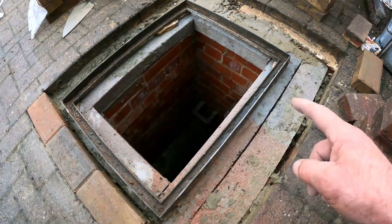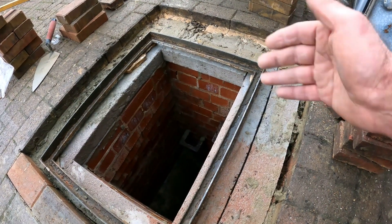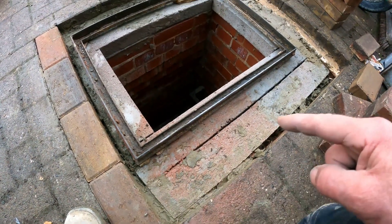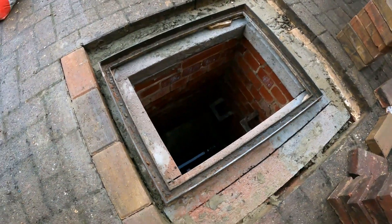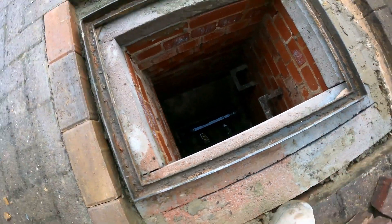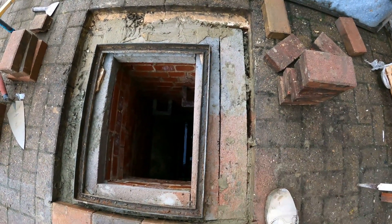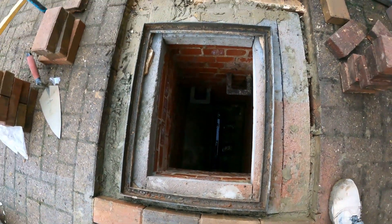Nicely bridged over the manhole there with them pre-stressed lintels — a little bit at the back there as well, about an inch coming in. I've got my frame there set at the height now. All I was left to do is bring these block pavers back in all the way around. And what I'll be able to do is just get some mortar and bed this frame in here — block pavers through there, out the back, finish that off, and then just get some mortar underneath that frame. That's a good job done.